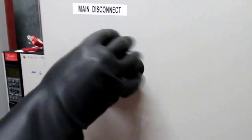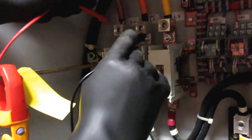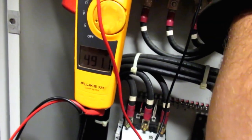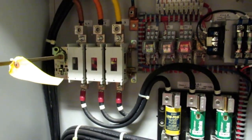Another point to remember is that just because the disconnect is shut off on the secondary side, there is still the danger of incoming power. You can see we do have voltage on the top side of the disconnect. Even though it is cold below the disconnect, the top side is still hot. So if you're working up in that area, shut off the feed coming into the entire panel.